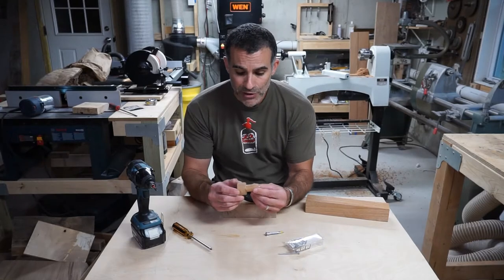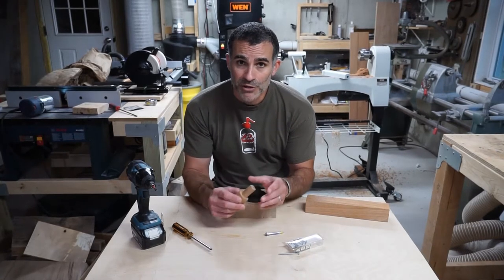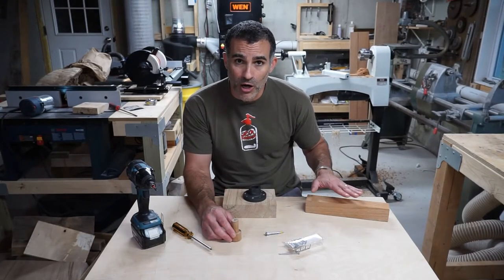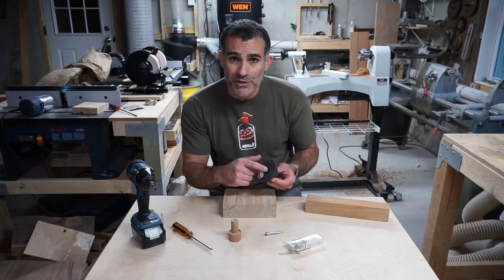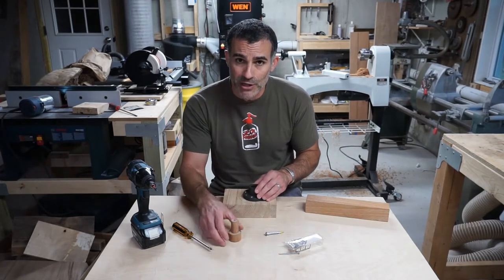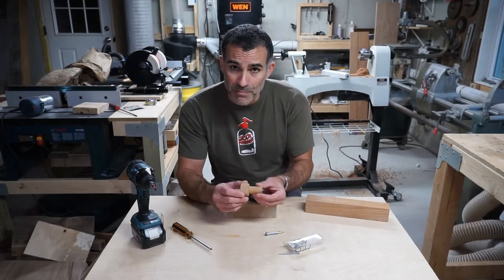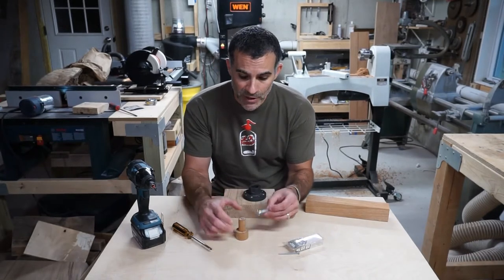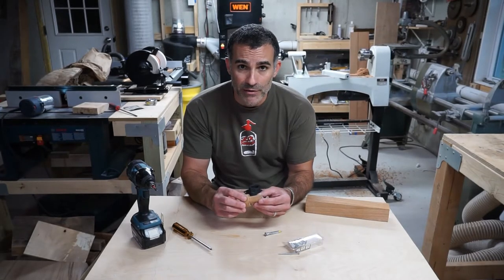So what I've done is create this faceplate centering jig, which I'm going to show you how to make today. You can use any scrap wood for this project, though I would highly recommend a harder wood, as the threading on these faceplates tends to be pretty sharp. If you're going to be using this frequently, it's going to extend the longevity if you use hardwood. The other unique feature of this is its adjustability — I've used a hollow wall anchor that will allow us to create the adjustable feature of this lathe jig.